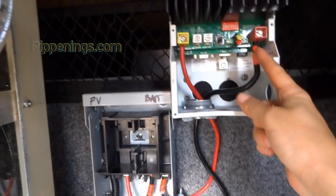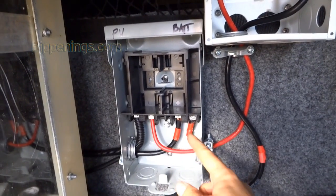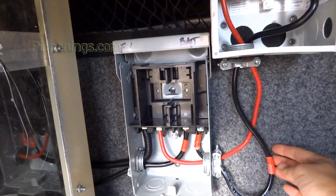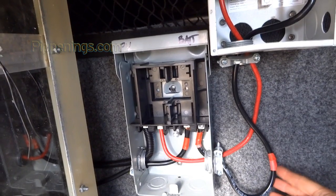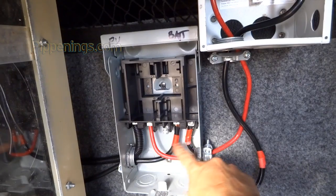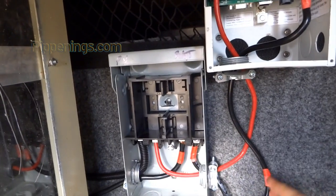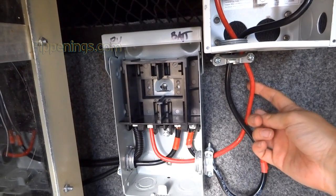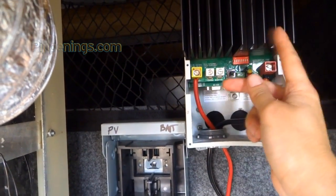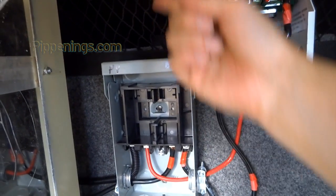All that I've added is the positive side to the batteries coming out. It goes to the fuse and then back out, and that's going to go to the positive post on the batteries. It is black — it should be red — but it's black just because the store only had black, so I've put tape indicators just to say that it's positive. The cable going out is larger: this is six gauge, this is four gauge, because the batteries will store current and can sometimes send more, so it needs to be bigger than what comes from the solar panels.